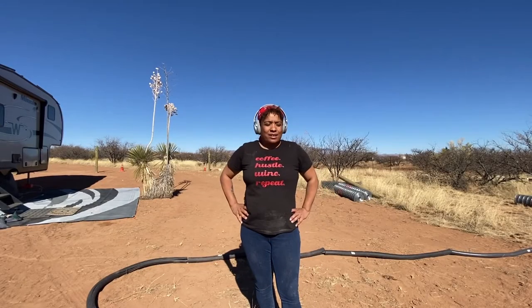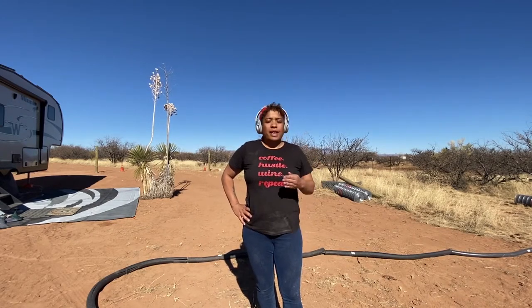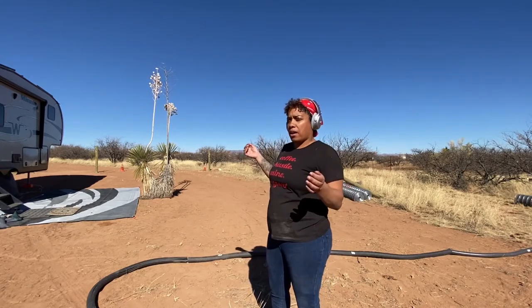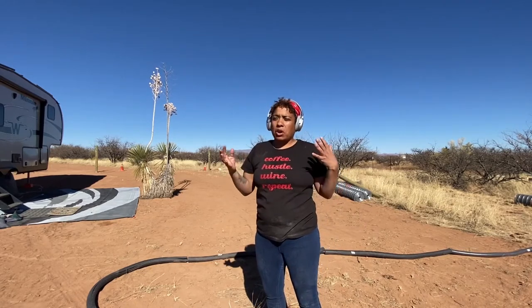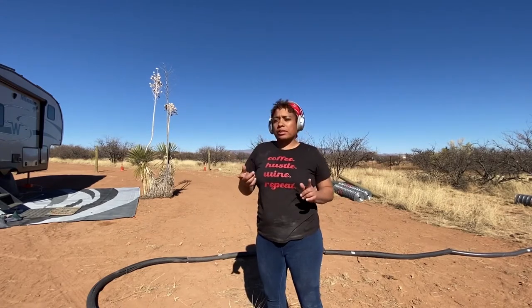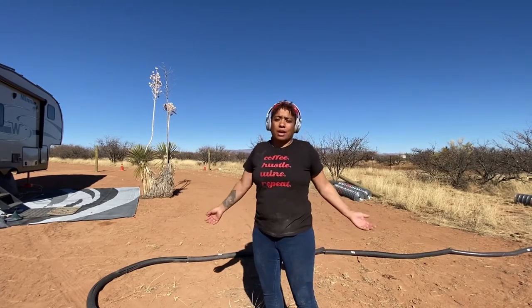All right, I'm back. So now what we're going to do is lay out all of the T-posts approximately 10 feet apart, coming up this line and going all around. And I think that's all I'm really going to do for the rest of the day today, because all the posts are still setting and I'm going to let them set overnight before I start trying to put any kind of tension on it with the field wire. So I'm just going to lay out the T-post every 10 feet and come back at this tomorrow. I know this is going to be a 2 or 3 day project.